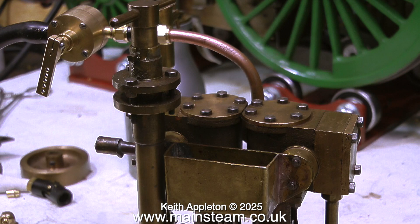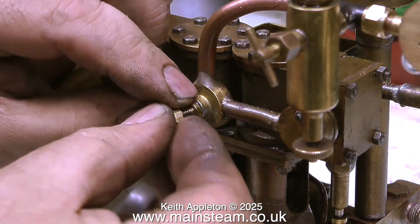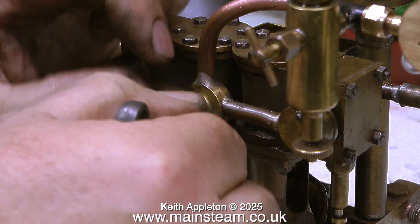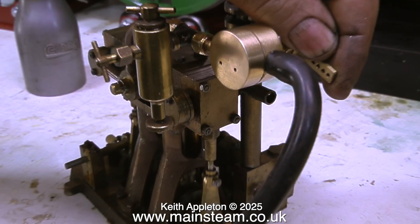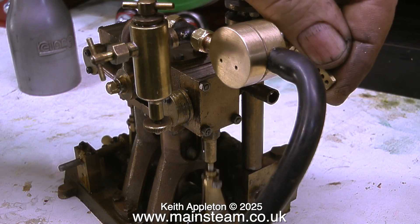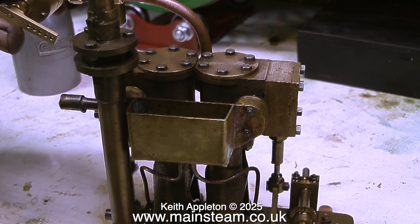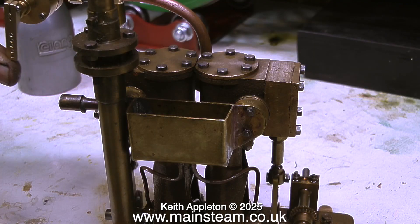For compressed air running I inject some oil into the airline. I also need to fit a blanking plug, which is fitted using a small amount of Loctite 542. With everything in place it's time to test it and see if it works — and it certainly does. This boat is of course going to be radio controlled, and the regulator will be connected to a servo using a long rod and a clevis. But for now I will function as the servo. I'll leave the engine running on compressed air for the last part of the video.